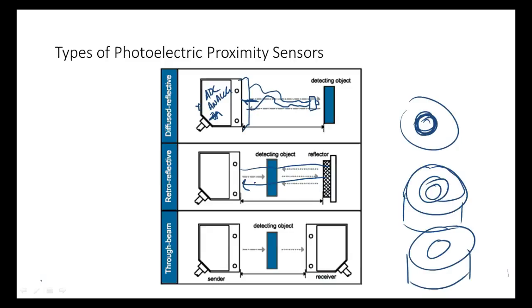If you take the sensors class, we'll use one sensor as a diffuse sensor or as a retroreflective. If you use it as a diffuse, your detection range is about this far. If you use it as retroreflective, you can run into the beam from much farther before it stops working. We've got it mounted on the panel right now so we can't easily measure the range, but a true through-beam sensor would have an even greater distance.